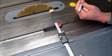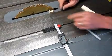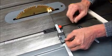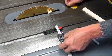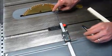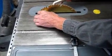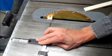Mark the blade. Extend the depth probe and set the zero on your calipers. Retract the depth probe. Rotate the blade so that the mark is on the other side. Slide the unit down and check your blade alignment.